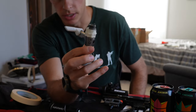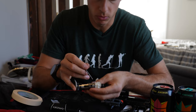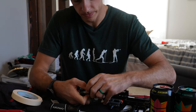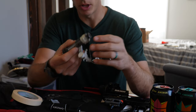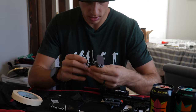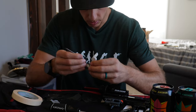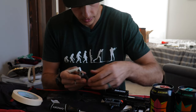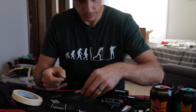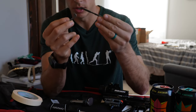After the masking tape is on, I'm going to take the old firing pin and push out this pin, which is holding this sleeve over the top, so I can push out this part here — this is where the ball bearings would otherwise fall out, so hopefully they stay in the sleeve. Then I can take out this next pin, which is holding in the bolt handle, and push that out again using the old firing pin. That allows this bolt handle to come out. And here's the back part of that firing pin — you can see how it broke right there at the back.